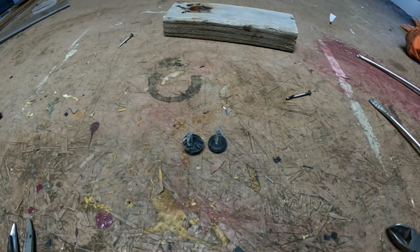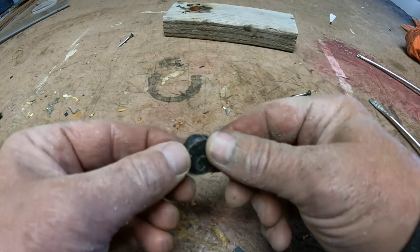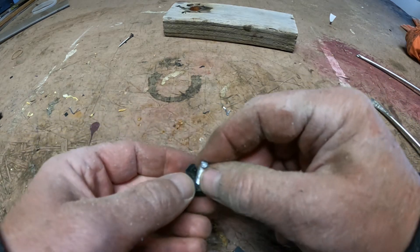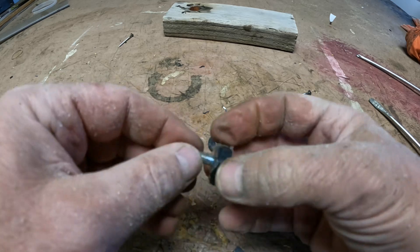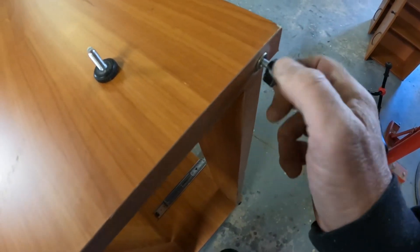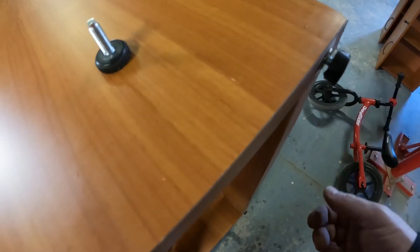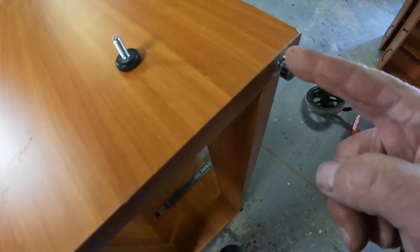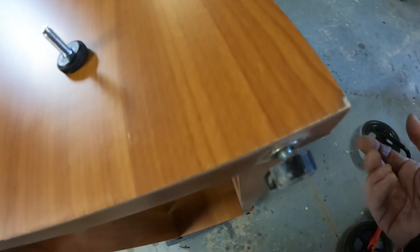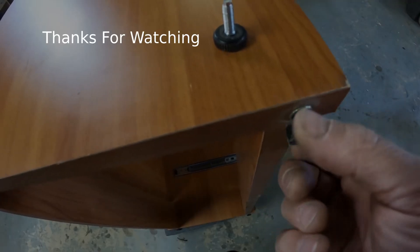That's how you can fabricate little plastic pieces in a hurry if you need to — just melt some HDPE2 or LDPE4 and go ahead and make your little part. You can spend more time on it to make it look better, maybe focus on getting the screw centered. If you look now, you can just put your foot right in there and it's pretty much going to function the same way as the originals. It took me literally five minutes. You can make them nicer, cut ridges in them — but there you go, looks good.